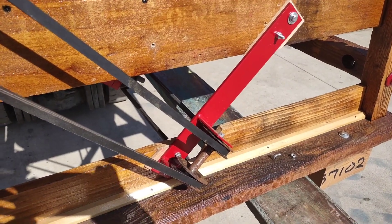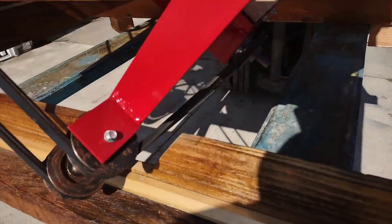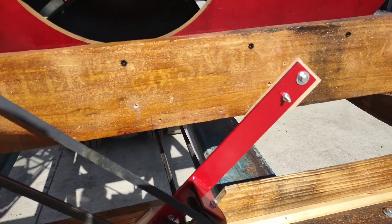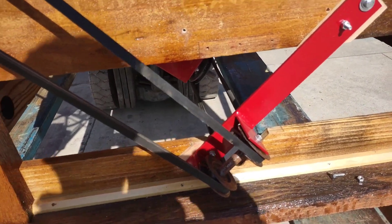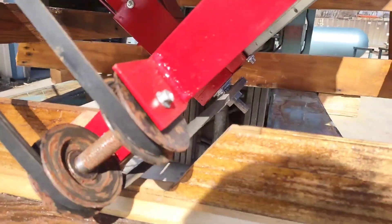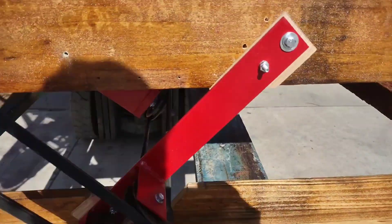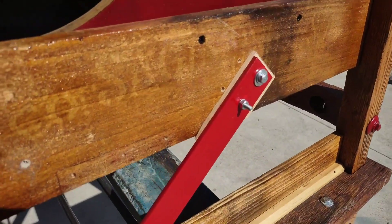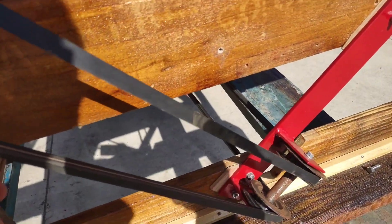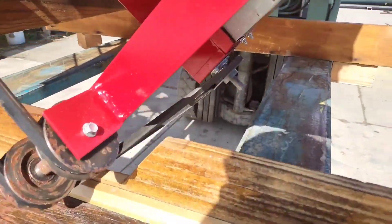This is showing the double pulley system and bracket for taking the belt around the underside of the cleaner and driving the auger from below. The important thing to remember when installing it at this step is to make sure that the belt is as straight as possible going to the pulley that drives the auger. Sometimes it may be necessary to put a wood shim behind it to make sure that the belt is at the optimal tightness so that the auger will run smoothly and not be stopped when it has grain in it.